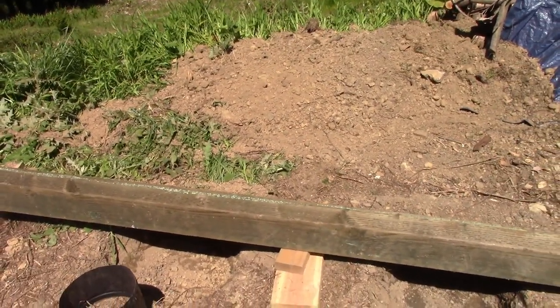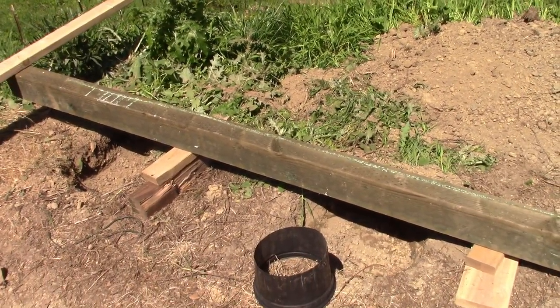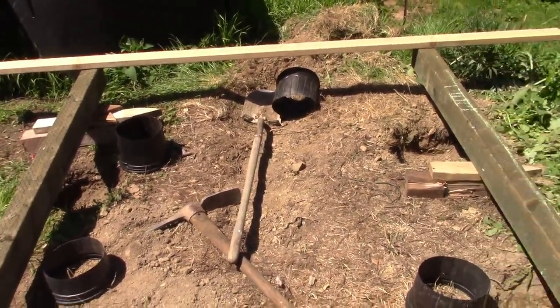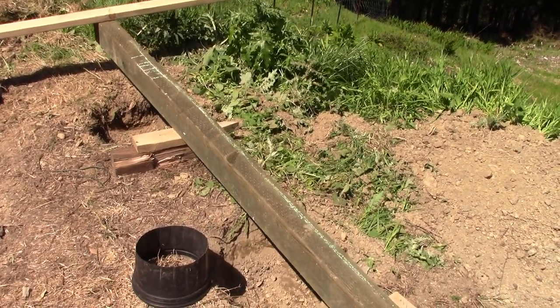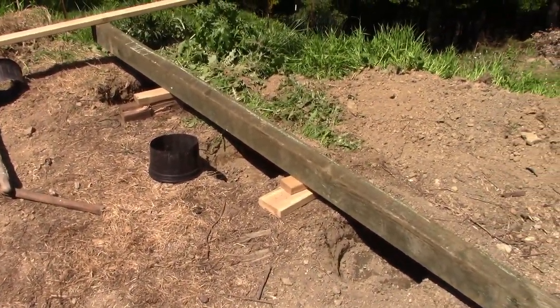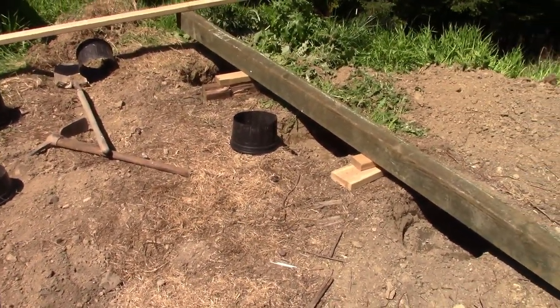The other thing is, everything's cantilevered. So these piers are approximately 8 foot, every 4 foot on center, so there'll be a cantilever more so on the back of approximately 2 feet or less, and then the sides, the joists will cantilever approximately 30 inches depending. These girders are 12 feet long. That's a typical length they come in.